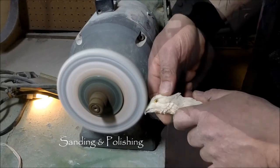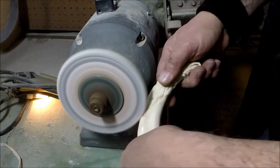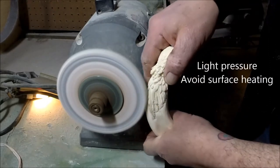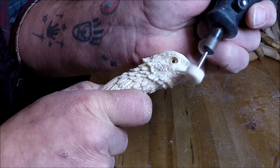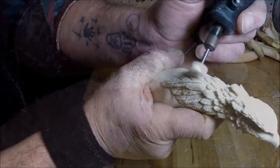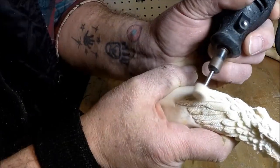We've already hand-sanded up into the fine grits in preparation for the polishing wheel. This not only cuts down the time we will need on the polishing wheel, but it's also going to allow us better control so we can keep a light pressure, get the surfaces polished, and avoid heating. Careful to stay off of the carved areas for now — we're still going to go in and tighten those up again. For smaller areas, we're going to use a felt wheel to get into some of those tighter spots. We're using a white rouge and gently going across the top, just highlighting the entire piece. We don't want to get too far in here, lose our definition, or cause burning.